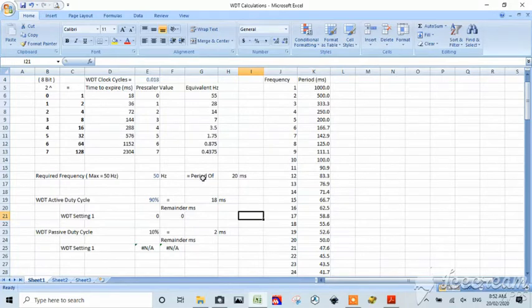we've got ourselves something that helps us to understand our 8-bit WDT. This is what this was designed to do. It wasn't really designed to sweep values and do all that, but we can start to plug in some numbers, right? If we have an external clock, then we can change this value, and suddenly these numbers are achievable with the current hardware with an external clock. An RTC, a real-time clock, will get us there, and we can still use the hardware we've chosen.